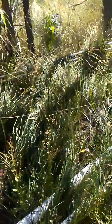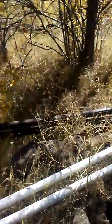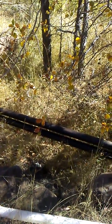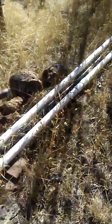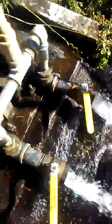This is the standpipe setup I have now, and it's worked out wonderfully — all metal. The only plastic is that overflow pipe. I did have steel drive pipes — you can see the steel ones laying right there — but there were tons of problems. The pumps would run for a while and shut down, sometimes five minutes, sometimes four or five hours. I couldn't get the bugs worked out, so I went back to the plastic pipes, and with plastic pipes the pumps have run flawlessly all summer because of the harmonics that develop in the pipe.